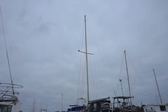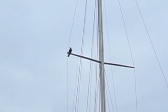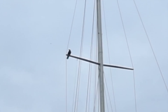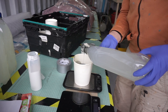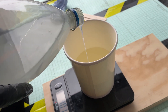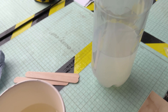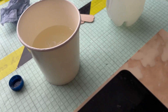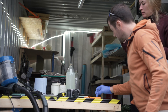Now for the resin pouring session. That crow is always there keeping watch but the black cat has been missing — is there something going on here? Preferably not, as any sinister semi-supernatural corvid feline plotting would get in the way of our important resin preparation session. To massively speed up laminating, from these purpose-made resin pots we can measure up doses the day before and we need a few dozen of them, all poured quickly and accurately from these decanted two-litre bottles. The resin, unlike the hardener, is stable in these bottles, but we do need to stop moisture interacting with the resin even though it's only 24 hours they'll be potted up. Polyethylene film and a rubber band will do it.